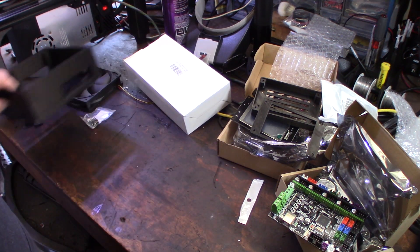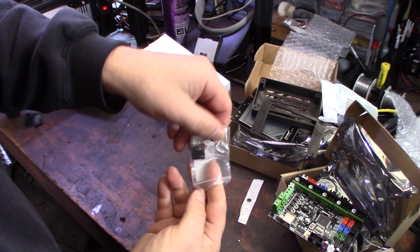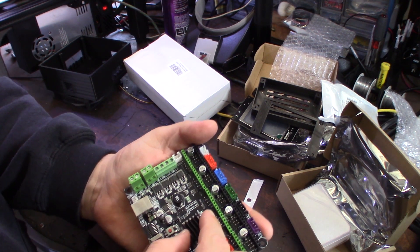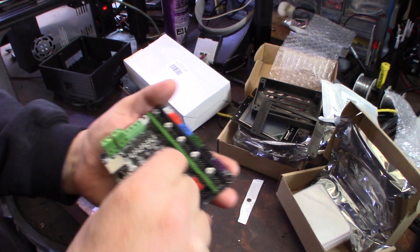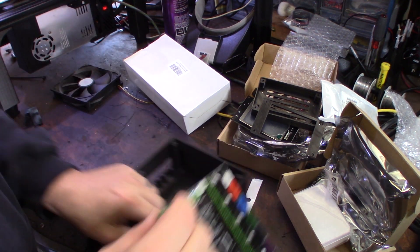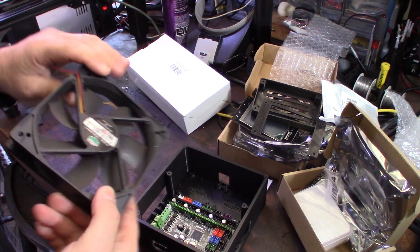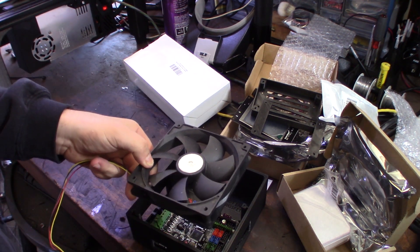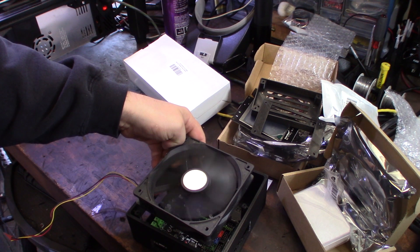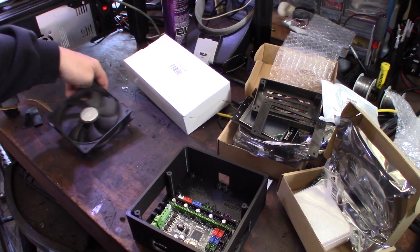The pattern is really consistent, so I'm not sure if it's a power issue. I decided to upgrade the power supply. I also bought a little heat sink for the Raspberry Pi 3, and I'm thinking about putting a heat sink on the ARM processor too — not sure if it's necessary but it'd be cool. The Trinamic drivers need good cooling, so I have a 120mm fan going on top to cool the drivers, processor, and mosfets.